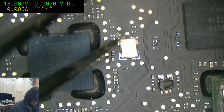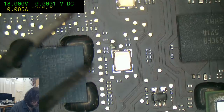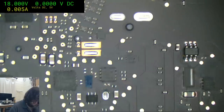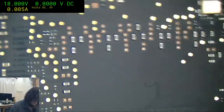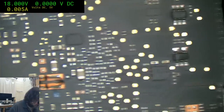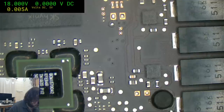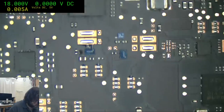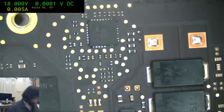Okay, there's a bad spot there. So the capacitor's also got a bit of damage on it. So that will affect the 12 megahertz clock there. But I'm going to say that the ISL is the actual fault. But the clock one would come into play probably a month or two's time. Alright, let's get repairing.